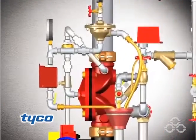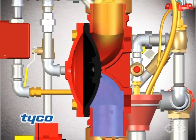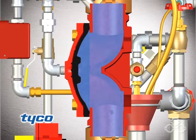This results in a rapid pressure drop in the diaphragm chamber, and the force that holds the diaphragm in the set position is reduced below the valve trip point.